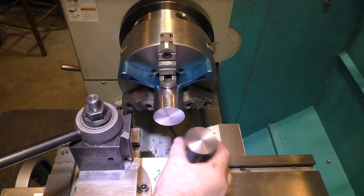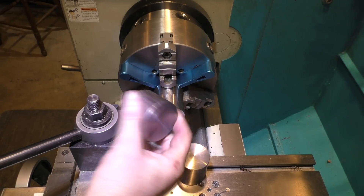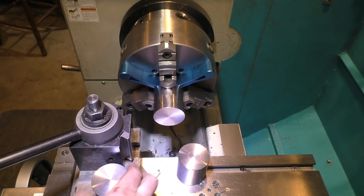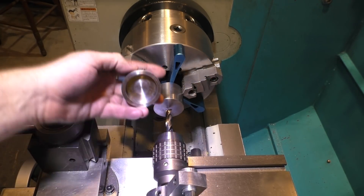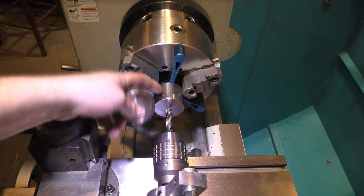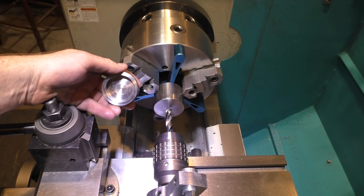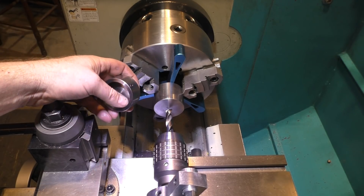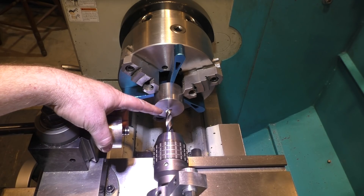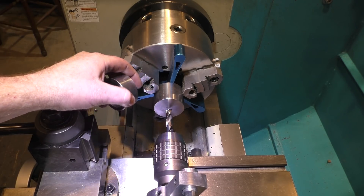I've faced and chamfered the three parts. Now we're going to start with the presser foot for the ram first, then move on to the two load cell plates. We're going to put the indented portion on this piece — going about 5/8 to 3/4 of an inch depth, not really critical. We're going to start with the drill bit, then work with an end mill to get a nice flat bottom and remove a lot of material quickly.